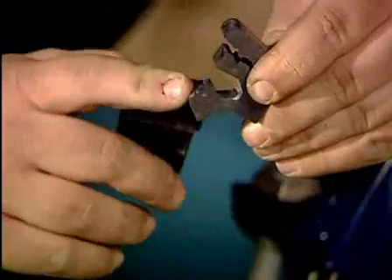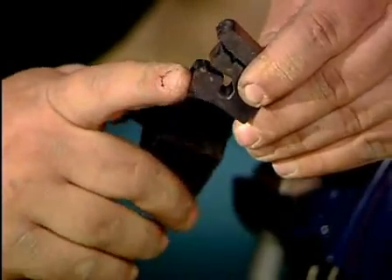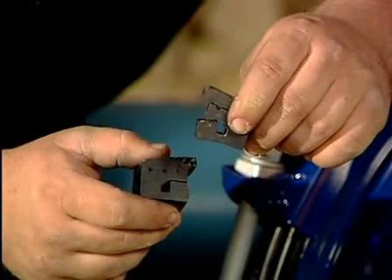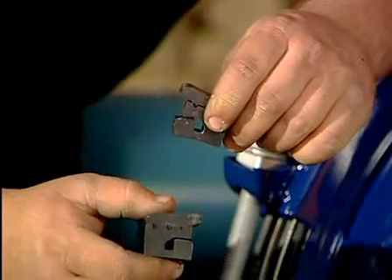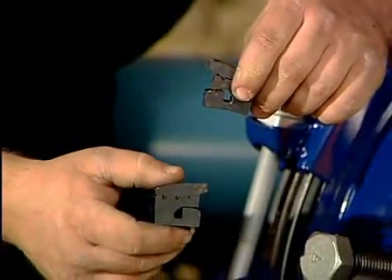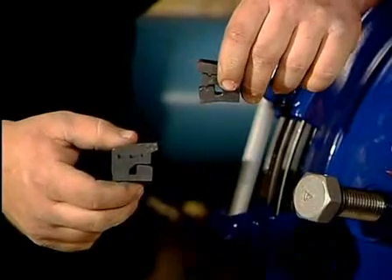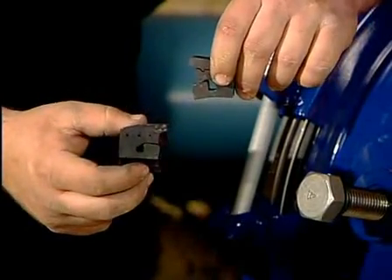So the higher the pressure, the tighter the seal. That is also the feature of the gasket that provides us with the ability to handle deflectional angles up to 4 degrees per end. No other coupling in the industry can actually achieve deflectional angles as high as the HiMax. That's a minimum of 8 degrees across the fitting, versus the old type couplings which were 2 to 2.5 degrees per end — so a lot more deflection and a lot more performance out of that product.